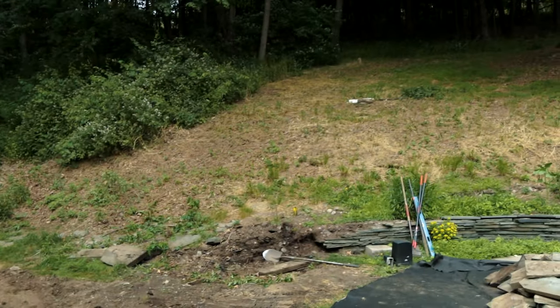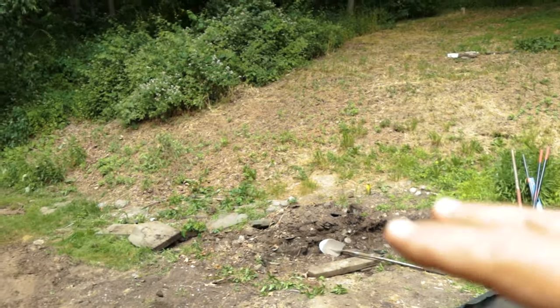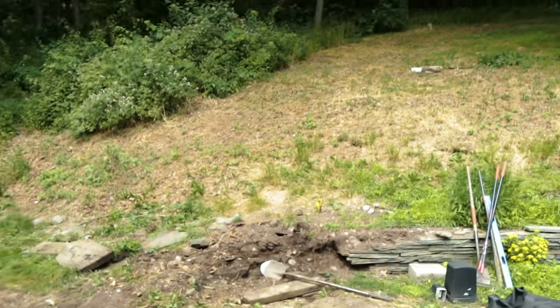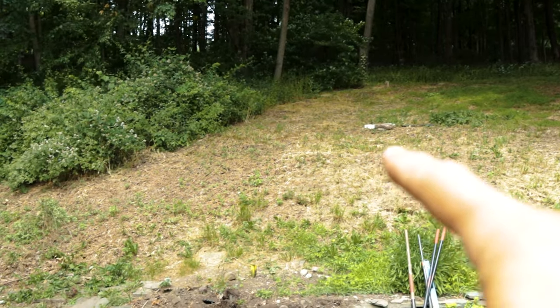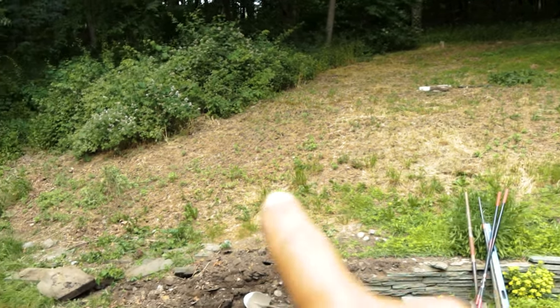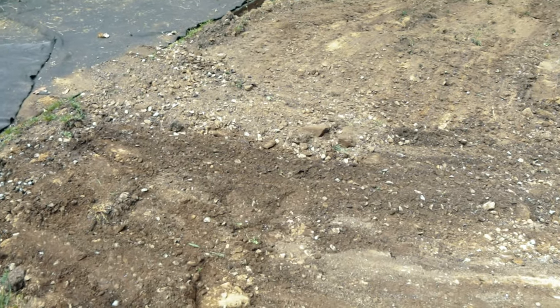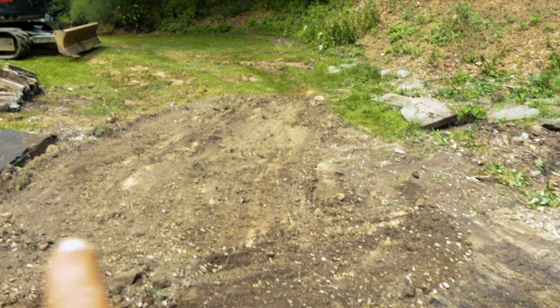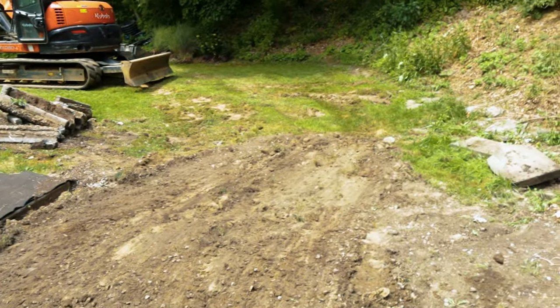I gotta start by talking about this hillside — that is just a dream right there. We're going to be carving into this hill, creating some massive cascades. We've got 100 tons of boulders coming in to create this water feature. Right up by that silver piece of metal, we're going to start the waterfall, and it's going to be doing some twisting and turning as it cascades down into our pond. We're going to incorporate the wetland filter into the pond itself, right off this pool deck, down about a foot. It'll be a couple steps going down into it — that's where we'll build our constructed wetland filter. From there, we're going out into the pond about three feet deep max. On the far side, we're building an intake-based skimmer — that's where we're going to house all our pumps and where all the debris will be pushed towards.